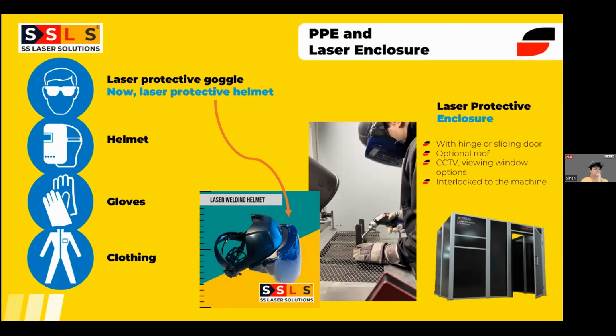I didn't put this in the slide, but there is also the fume extraction topic, not specifically for laser welding, but fume extraction is a must. Either you should have a mobile extraction unit or a fixed extraction system in the factory, but welding fumes have to be removed from the environment. So don't think that laser is less dirty or whatever. We are still melting the metal, so that creates fumes. It's not different than any welding system.